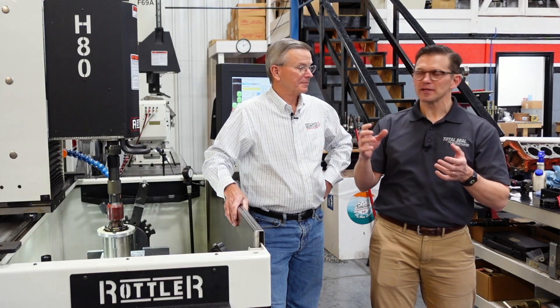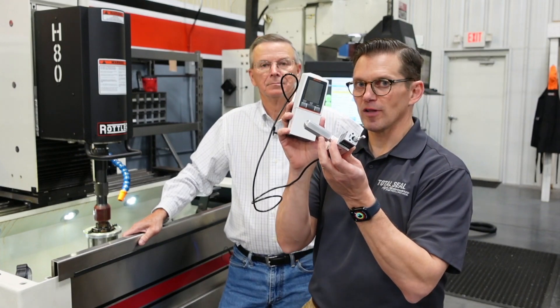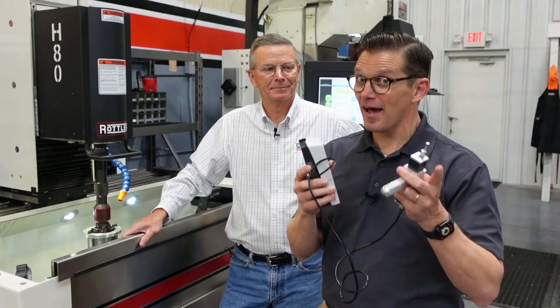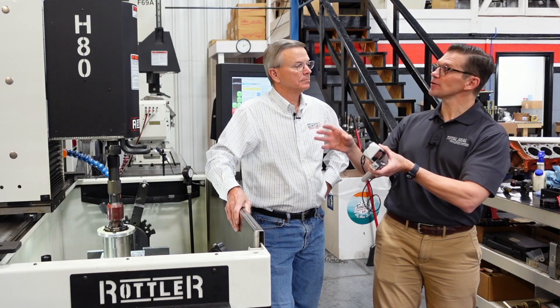There's a little company down in San Antonio, Texas called Southwest Research Institute. They have a huge tribology lab, and one of the things they have the ability to do is take a cylinder — like the one we have here that we're gonna hone today — section that cylinder, take a section of a piston ring, rub that piston ring against that cylinder, and they have an optical profilometer. We've got our handy-dandy profilometer right here that we use, but this is only 2D — it only takes one little trace through one little area. Down there they have a 3D profilometer. So what we're gonna do today is get these cylinders honed so they can section them and 3D profilometer those cylinders before they run their test.